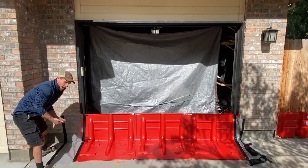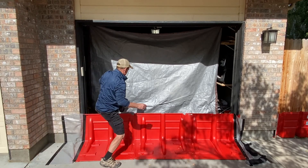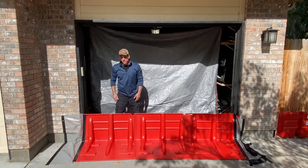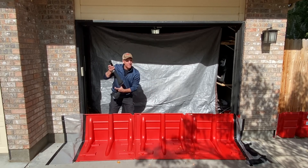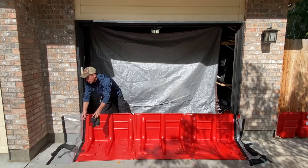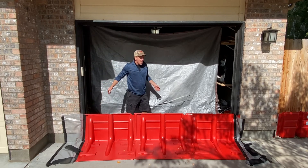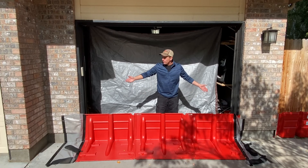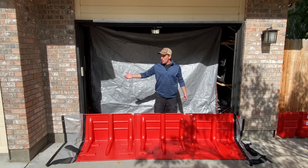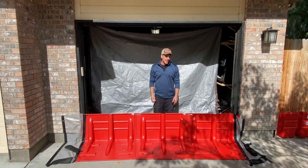As the water rises up, it's going to press against this plastic, and the seal holds because the plastic doesn't move. For added effect, I've got my extra sand socks. And that's how you can easily and effectively seal off — or tie — your flood barrier into a wall using plastic and some duct tape. Thanks for watching.